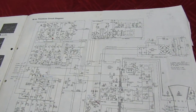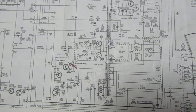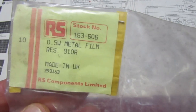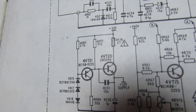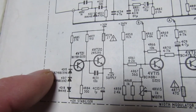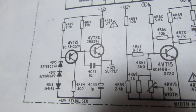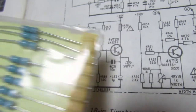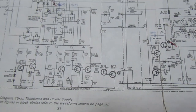This doesn't have a separate power supply - we've just got rectified and smoothed mains, which gives an HT rail of 260 volts. All the regulation and picture breathing is carried out in the line output stage. One of the most common faults in these is the 910 ohm resistor in the 12 volt regulator. You're dropping 30 volts down to 12, so it's not surprising this was the most unreliable part of the circuit. I've got plenty of these resistors, so let's look at a few more quirks before we do anything.